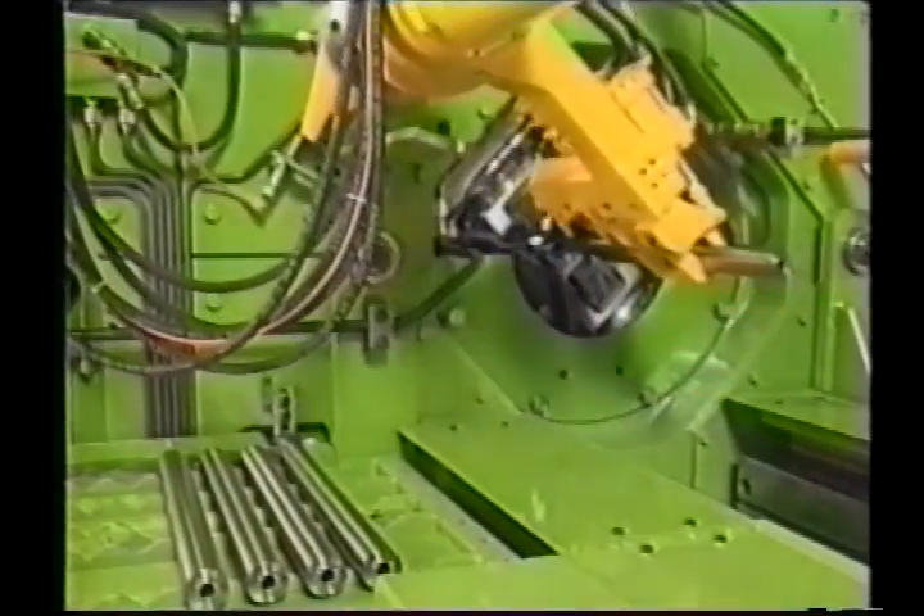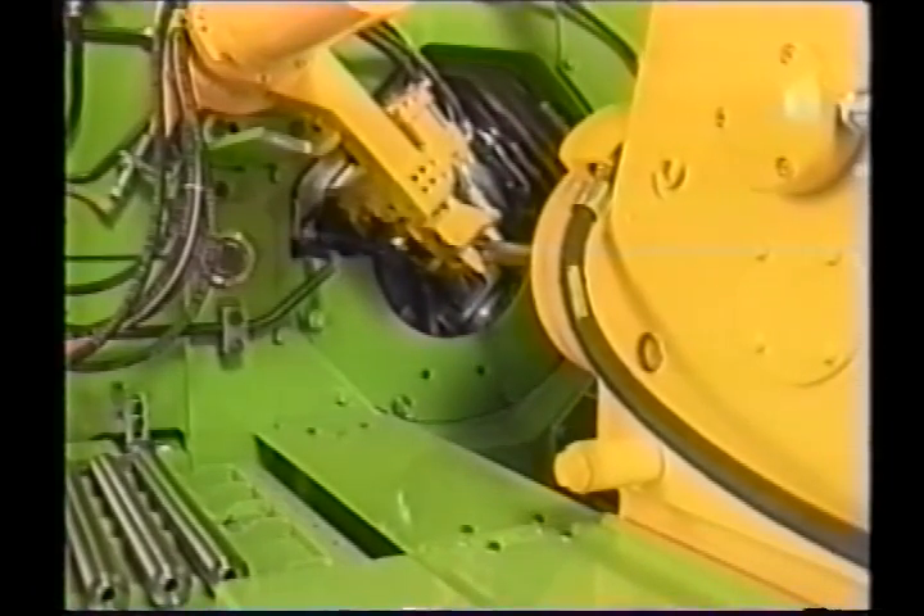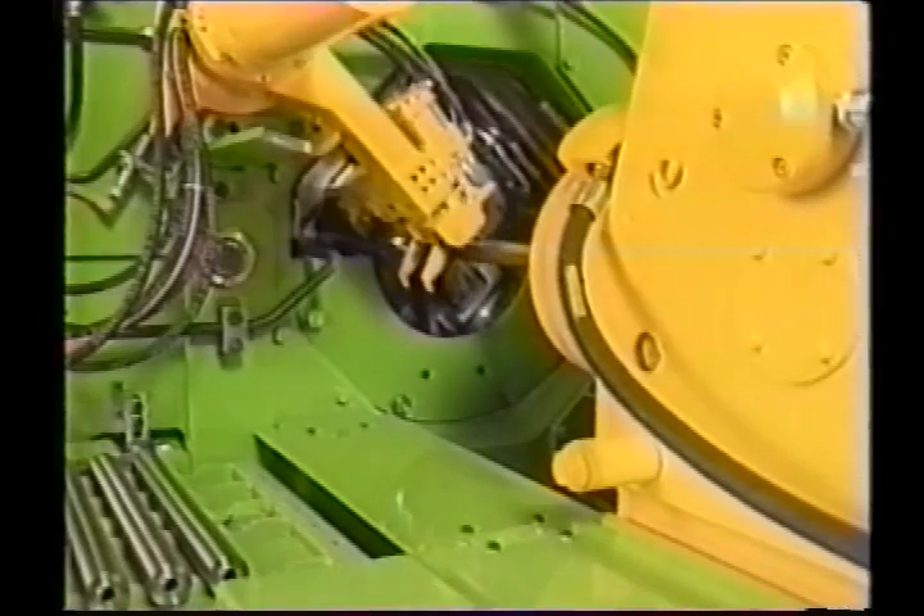The blank bore is roughly 0.2 mm larger than the maximum diameter of the forging mandrel. The cross section area reduction is 25 to 40 percent, just enough to form an ideal profile.